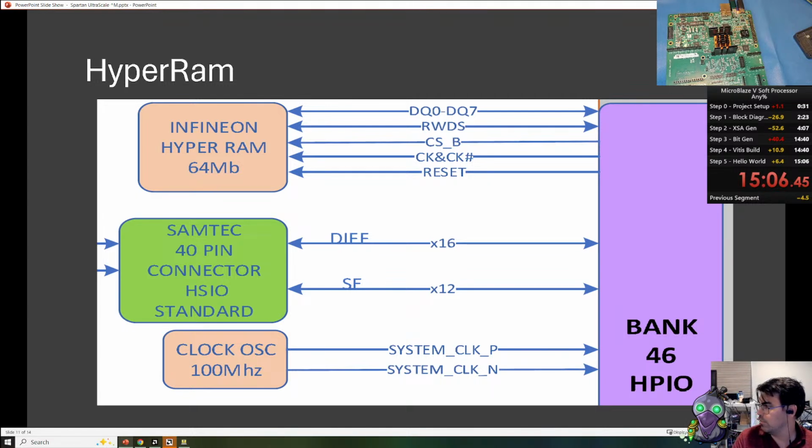Okay, we have a question real quick from Rishi on YouTube. Have you tried using two RISC-V processors? How does the Vitis IDE handle that? So the Vitis IDE identifies these as two separate processors. So you create two separate domains, and then what you can do is you can have an application per domain, and it's very easy to then just target that application, modify that application for that specific processor and change it. You can also easily switch which domain or which ELF file goes for which processor. There's a lot of nice settings for it.